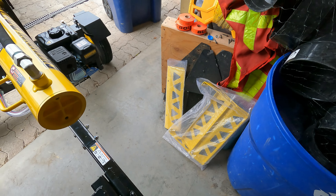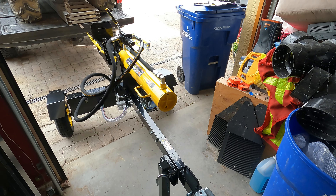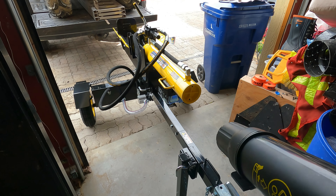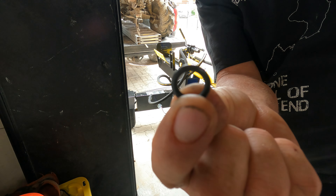The guards are on — pretty easy, just four bolts on the side and two at the top. They actually give you a canister for the instruction manual which screws to the side, so we'll put that on. Now it's just about putting in oil and stuff, so I'll probably wait till tomorrow. I'll pick some up and top up the oil. One thing I did forget was the o-ring — the o-ring goes down on this hose here, so I'm just going to whip this off, put the o-ring on, and we're done.